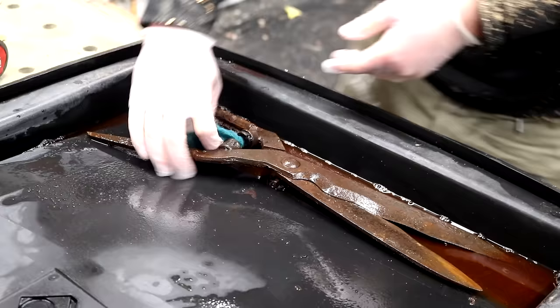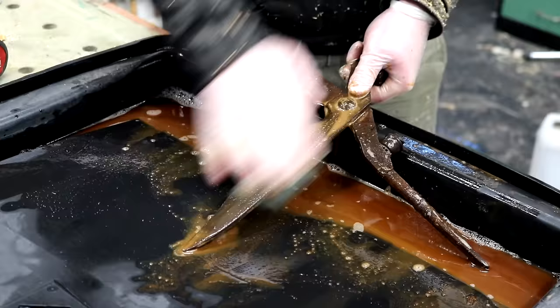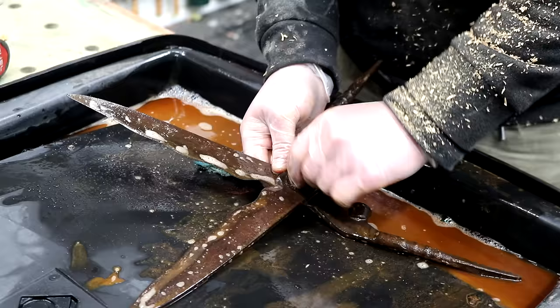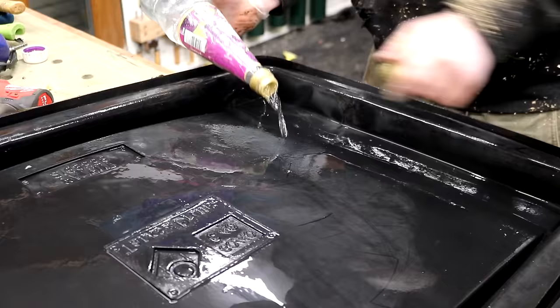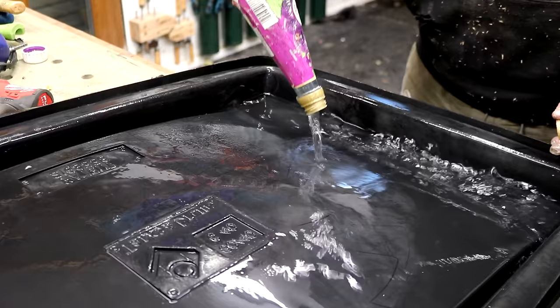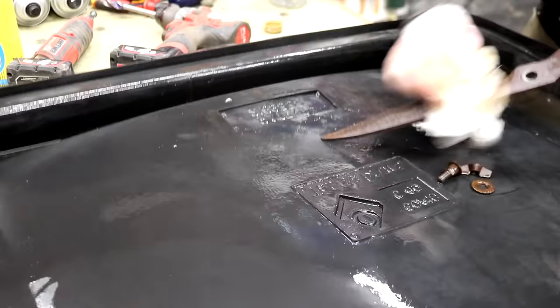I needed to measure up the tangs on the shears next, so I started scrubbing off the rust and most of it came off, although I'd only left it in the vinegar for less than an hour. I removed the wing nut — which to be honest I probably should have done before putting it in the vinegar, but never mind. Then I washed away all the vinegar with some clean water to stop it eating away at the metal.